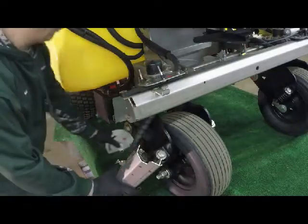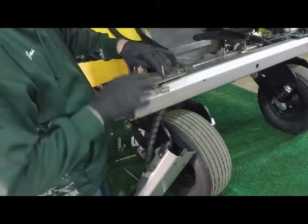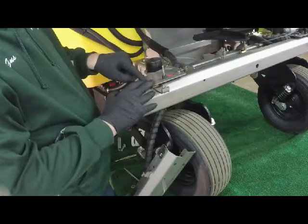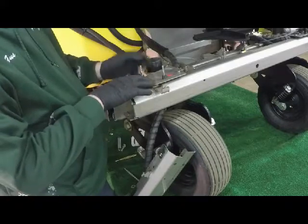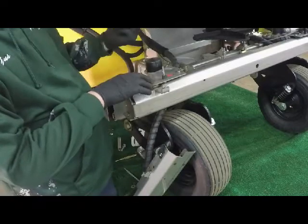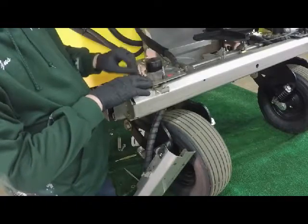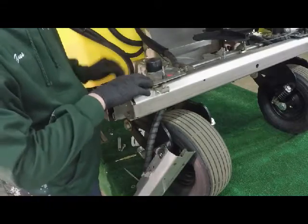Okay, so as far as the installation, we're working on the motor mount bracket itself. We've got a 1/4 inch bolt through the hole that we drilled on the outside edge, and I've also put in the Phillips countersunk screw bolt on the second hole that we drilled. While I was at it and things are still loose, I put the 1/4 inch bolt from the bottom going up in place right now, 2 of them. This is where we mount the motor eventually, and I put the bushing in place just to hold them in place for now. I'm not going to tighten anything up, but I'm going to continue to install.